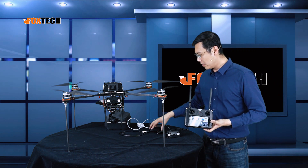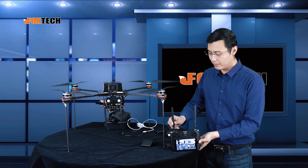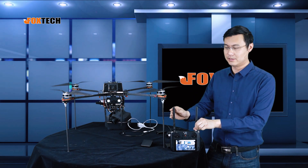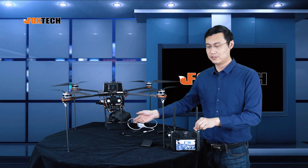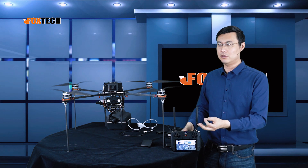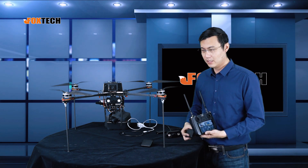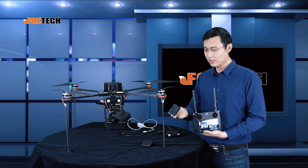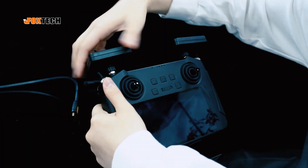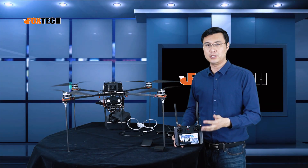The range is what you are most interested in. With the omnidirectional antenna, you can realize 10 kilometers without any problem — both the data radio and the video link. But if you want better range, you can swap to the small patch antennas — replacing both omnidirectional antennas with directional patch antennas — and realize up to 15 kilometers in very good conditions.